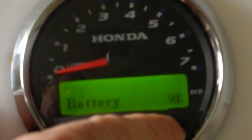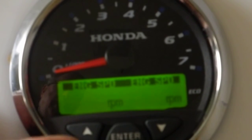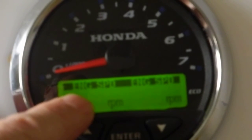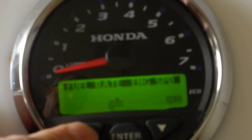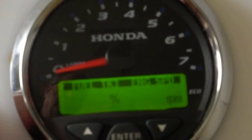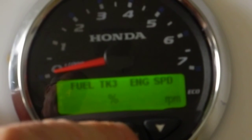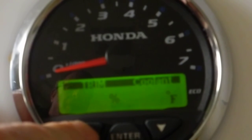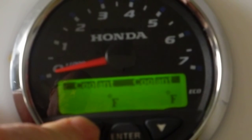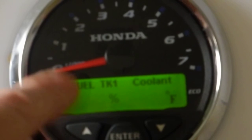Let's set the other screen — go down to where the dual setup screen is. I hit enter and notice how it reverses out at the top. In this case, I can only go one direction with this button since there are two screens here. I press the button to toggle through the available data on the CAN bus. I'll select fuel tank 1. Hit enter, and now it says fuel tank 1.